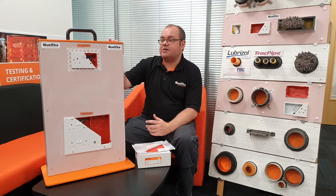When it comes to metal socket boxes, we've done a lot more testing. The reason is because the applications are usually different. Most manufacturers will only test plastic socket boxes. Now plastic will cover metal, but it will cover it for integrity-only fire resistance. So if your wall requires both integrity and insulation, then you should use test evidence that has been tested on metal socket boxes.